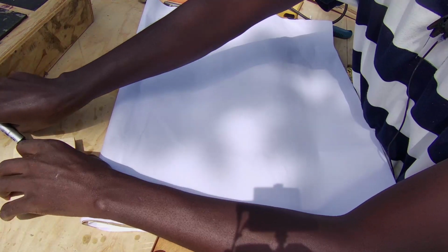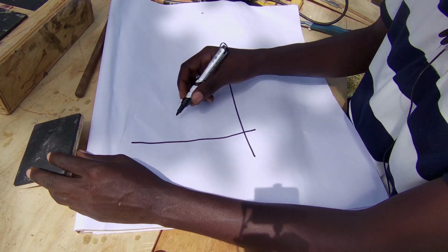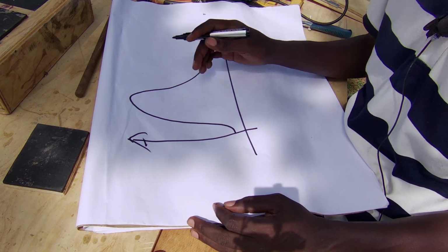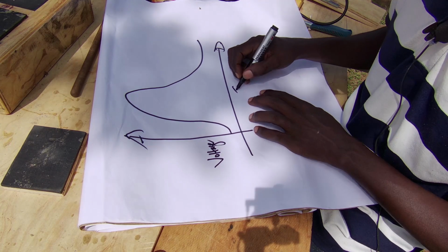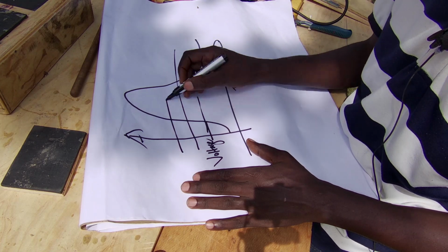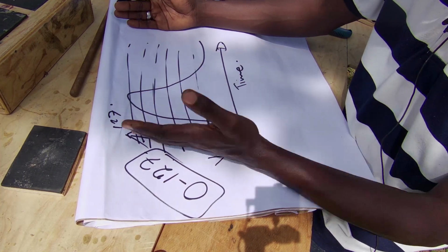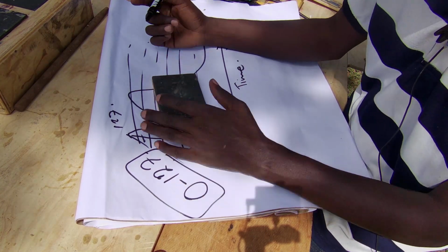What will happen when a stick hits the pad is that there's going to be a voltage spike, which looks maybe something like this with a decay. I don't have an oscilloscope to trace out exactly what it looks like, but it's going to be something like this. This is our voltage and how it goes over time, and this is time. So we're going to be reading from the analog inputs the level of this voltage, and then you can map the readings that we get from 0 to 127, and then we can interpret that as the level of velocity, how hard the drummer is playing the pad, and that is how we make it velocity sensitive.